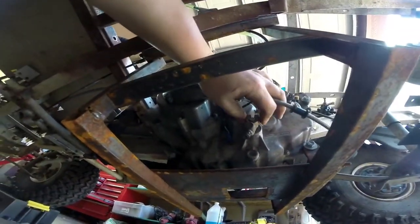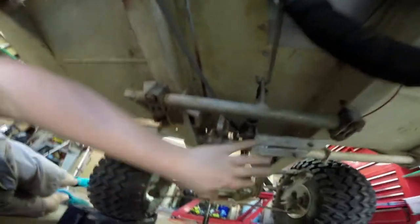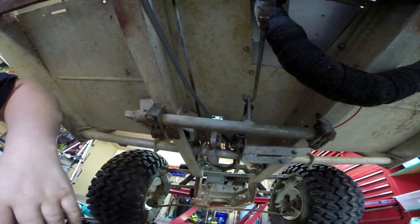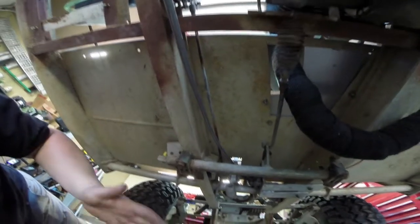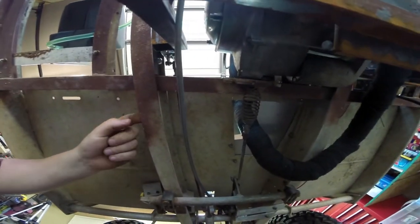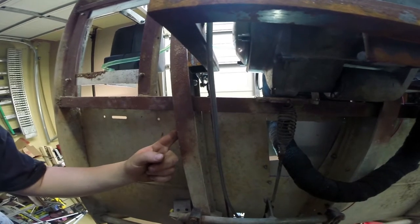We're down here. I remounted this — this is our little shift lever arm. I still need to tighten that down a bit. There's a clear path, but this is where things get complicated because we have our brake master cylinder down here, our throttle spring over here, just a bunch of stuff going on. I want to put the shifter right here next to the exhaust. It is going to be kind of tight against the driver's leg, but as with a lot of the packaging constraints on this golf cart project, we just have to do the best we can. The plan is to run that steel bar through the frame rails here and here, using a cotter pin or something to secure it on the outsides, running behind the exhaust with the shifter basically right here and the fulcrum about two inches down.